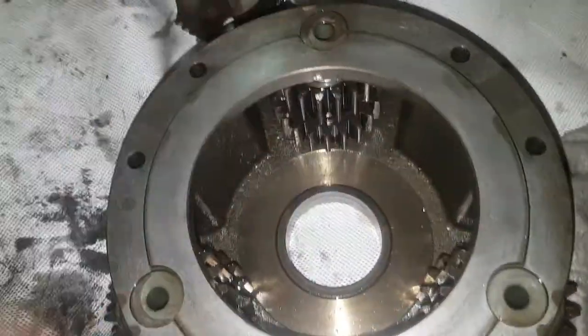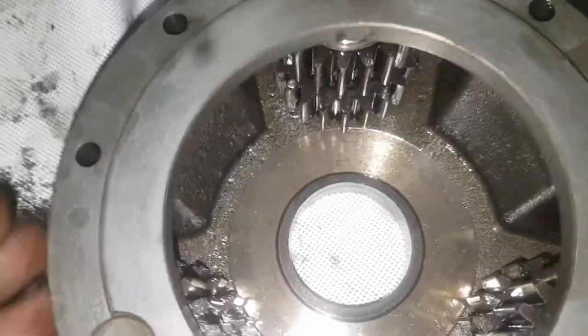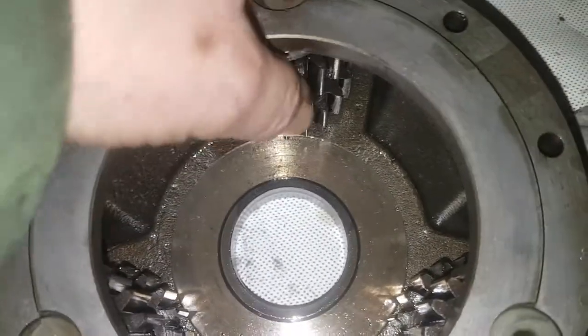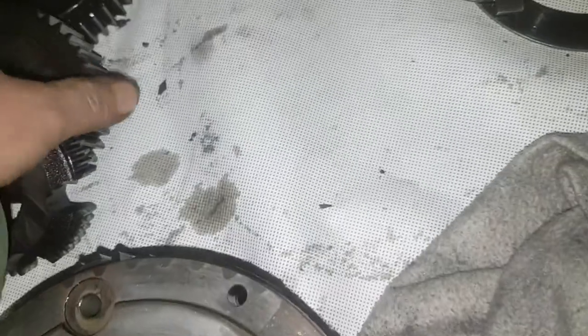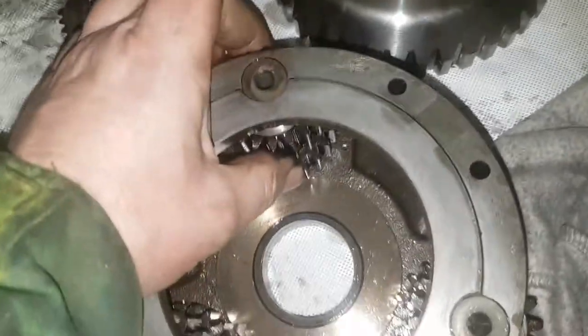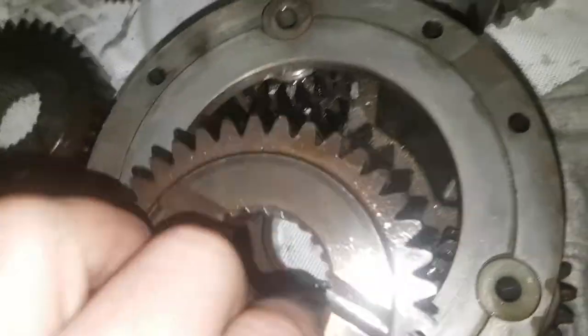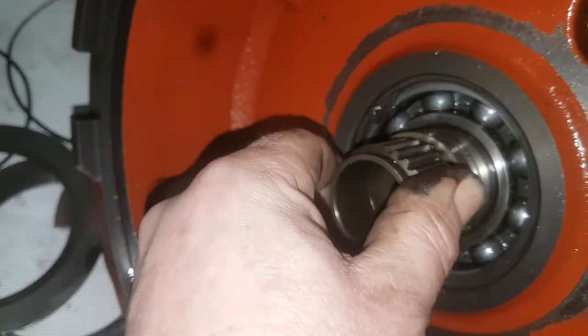These are planet gears. So your speed shift, you go from walking to running — it's a little button on the dash you can press on the go. It's a power shift device. What that does is it engages these clutches, and depending on which one you select and the pressure's on, you're in low. Transfer power to that one, and when you're in high it transfers to that one, and through that planetary set, back through the centre of this — that's the reduction for that.